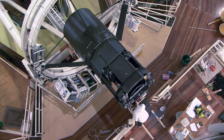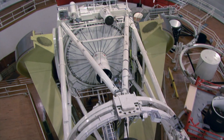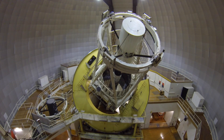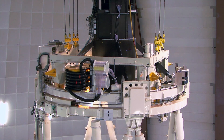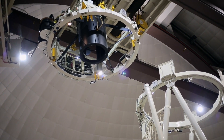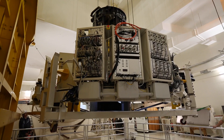The process of aluminising involves several stages. Mechanically, you obviously have to pull apart the telescope. To remove the mirror from the telescope, it's not just a question of undoing four bolts and the mirror falls out. It's quite a complex process. One of the key things is that the telescope itself is very finely balanced — it's got pivots which allow it to move to track around the sky. So you have to make sure the telescope is firmly fixed in position. We also take the top end off the telescope, the dismountable bit that allows us to change the focus. You take that off to remove some of the weight, lock the telescope in position, and then begin removing things at the lower end.